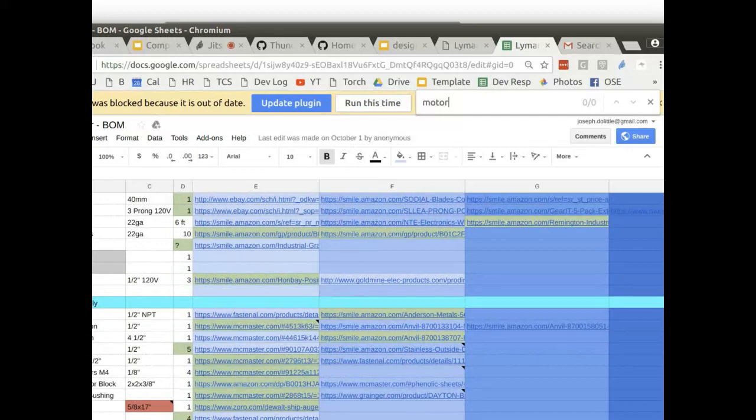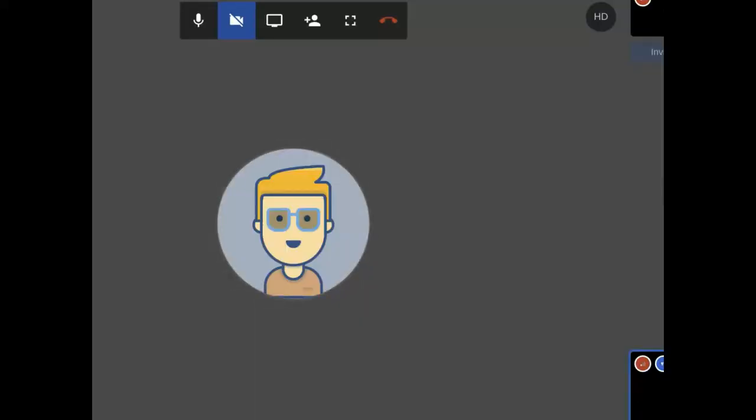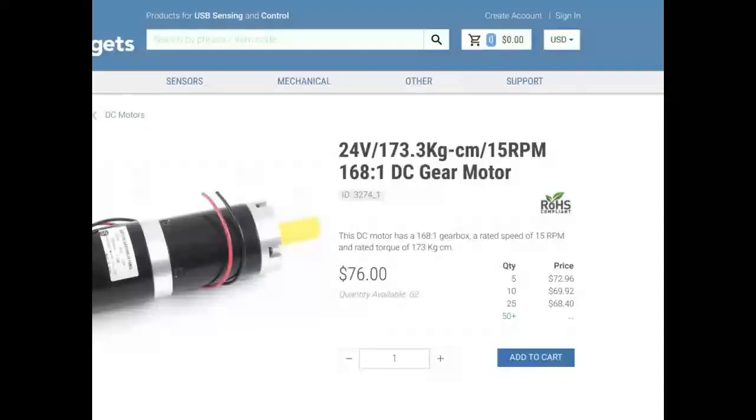Gear motor, 15 RPM. We typically run at 50 to 60 RPM. So you guys are really pushing it. Yeah, and I would even like to run a bit faster. I've run it up around 70, but at that point it's just at its absolute torque limit. If there's a flake that jams between the screw and the barrel, the screw can't shear it off, and the motor just starts skipping steps and automatically stops everything.